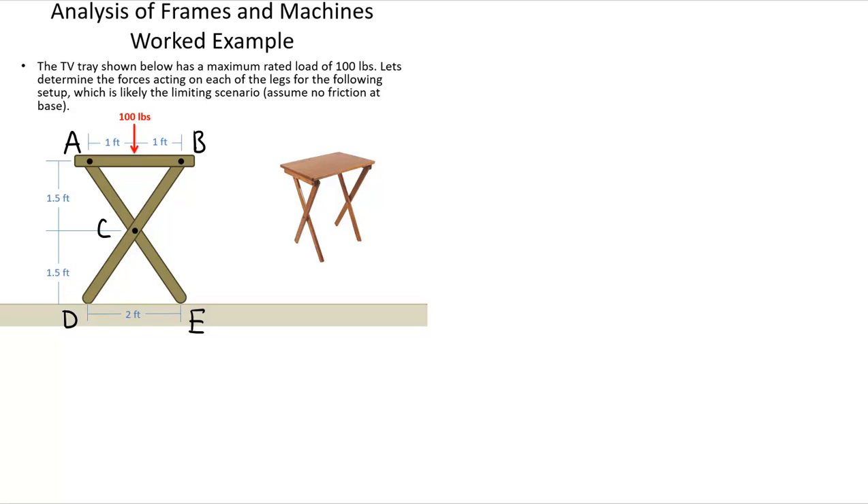Next, I also want to check if it's independently rigid. This is independently rigid — that means if I pick the whole thing up, it would be one solid piece. There might be some folding mechanism, but as I've shown it with all pin joints, this is not going to allow any motion. If I pick it up, it'd be like a stool or a chair where no pieces can move relative to one another. That's what lets me draw out the free body diagram of the whole thing.